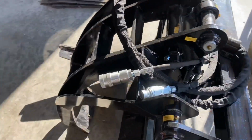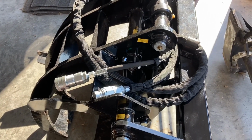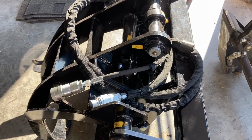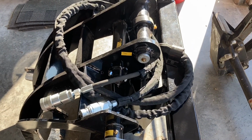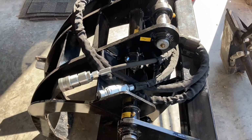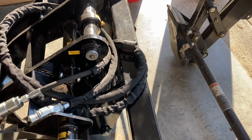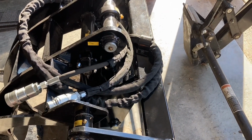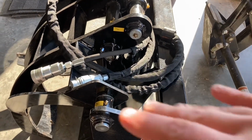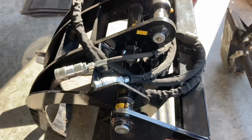So when you set it down and release all the pressure, the hoses come right off. But then when you go to put it back on, it's nearly impossible. So we came over and jacked with it the other day, and I think we've got it figured out. So once you get it set down and unhooked, then when you come back into it, don't hook up to it with the tractor physically. Hook the hoses up first, and then it should be smooth, because if you pick it up with the tractor, then you're messing with the pressure with the little nose thing down there.